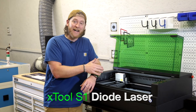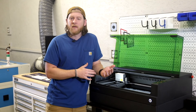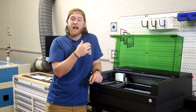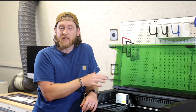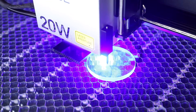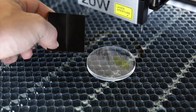Another type of laser is the diode laser. This is our Xtool S1. In my opinion, I consider a diode laser more of a hobby-style laser compared to a CO2 laser, only because of the speed and abilities it has. These can cut many materials as well, but they have what I consider more limitations. Diode lasers, because of the way they generate the laser and the wavelength of light, can't cut all substances. For example, a CO2 and a diode laser can both cut acrylic, but because of the wavelength of light in a diode and how the laser is reflecting through clear acrylic, I can't cut clear materials on here.